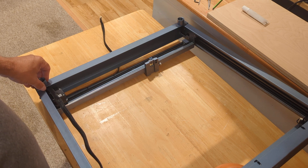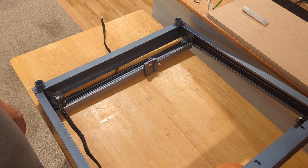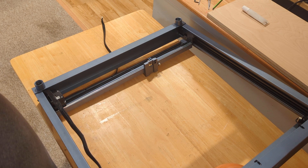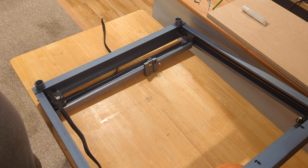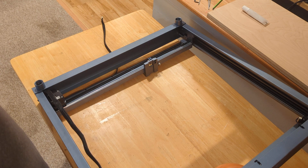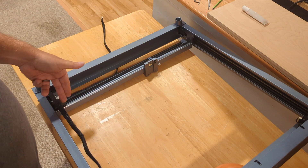I had my job set up on the plate and as always I was framing it, and I noticed something weird. Every single time I would frame — I usually frame a couple times, it's a good practice to make sure you're being consistent — every time it reset on the X-axis it would be two or three millimeters closer to the center.